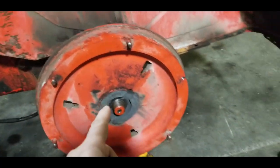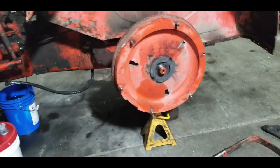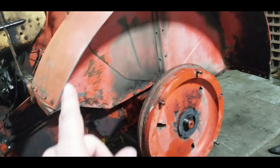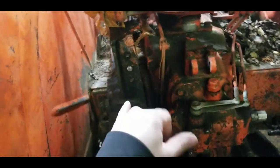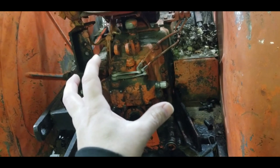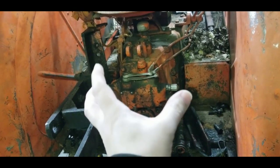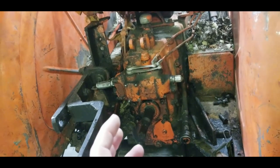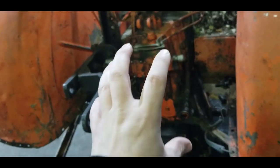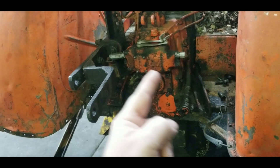But because I can't remove this disc, we're going to take this off in one piece, and the clip is in behind. The fenders do got to come off on both sides. The work platform, which are these two steps here, they have to come off. And then we have to split this transmission. The complete back end of this tractor is coming out. That's your PTO drive, your PTO clutch packs, your hydraulic remotes, your hydraulic remote drive, and your hydraulic pump, all in here. This whole back end has to come off for two nuts that are on the inside to get these axle stubs off.